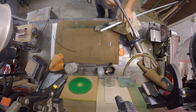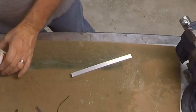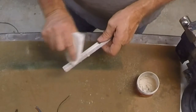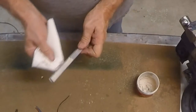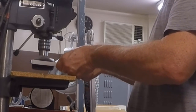I started out by cutting some 3/8 aluminum channel with my hacksaw and a vise, and then I spread a little bit of Mother's aluminum polish on with a paper towel. I kind of just went over all the edges there, and then took it on over to my drill press, which I have a buff pad set up, and spent just a little bit of time on it.